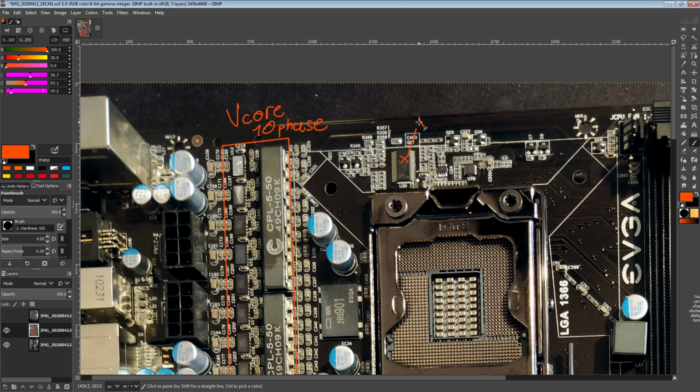So this chip right here, and for that matter, there's actually a 12-phase controller from UPI that I think is even older. I think you find it on like the HD 5870s. It's kind of funny. I'm not sure about the dates for this, but basically you could get up to a 12-phase controller for a while, and then eventually all of those went away and you couldn't go past 8 phases for a very long time. And then more recently, we're starting to see the 10-phase, the 12-phase, and the 16-phase controllers again, though previously there's never been a 16-phase as far as I know.